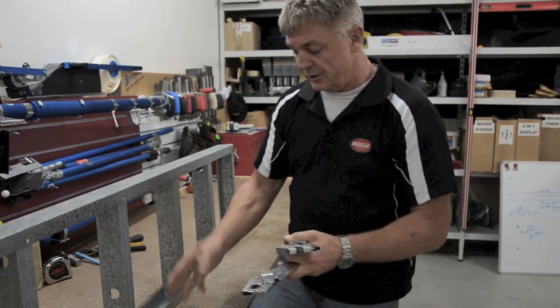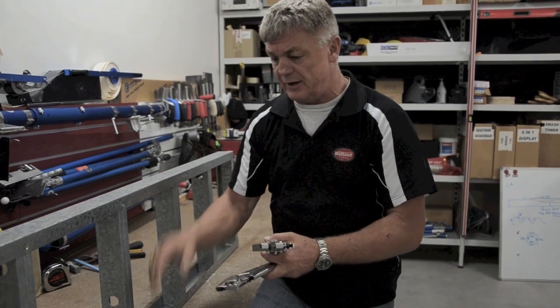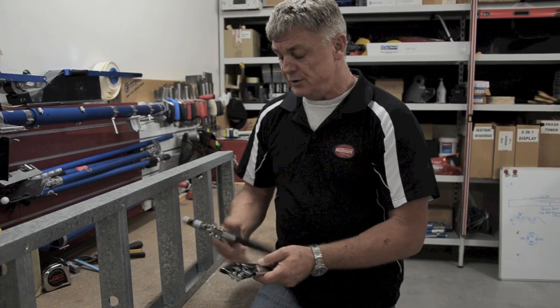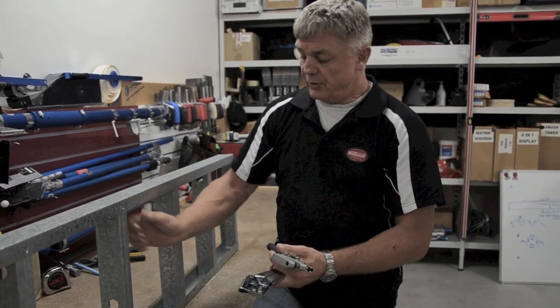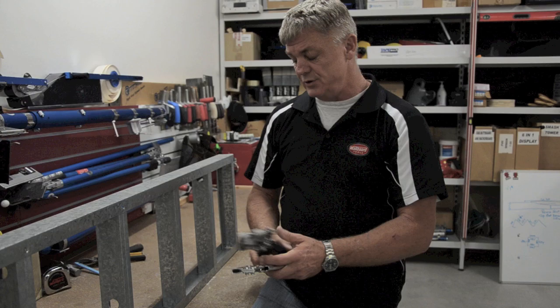The reason for a crimping tool — it's a lot easier. You're not using pop rivets, you're not using button head screws to lock your stud in prior to sheeting. So you're saving on material, you're saving on time. Sheets go through and you've got nothing proud on the front to hold the sheet out, so it gives you a nice clean surface to finish on.